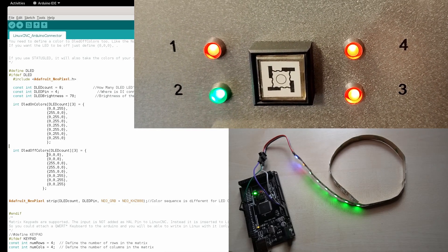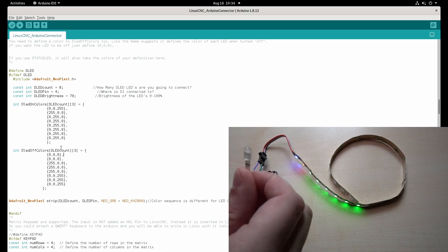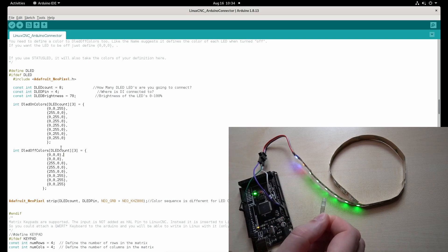I use this in my machine. Each LED requires one bracket with three values standing for red, green, and blue. The order can be different for each LED type, so you can just try it out — there are three values to switch and you can see which color is which value. You can set a number between 0 and 255, where 255 is maximum brightness and 0 is off.